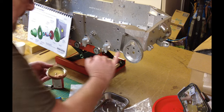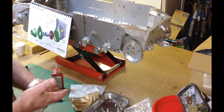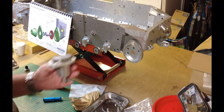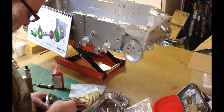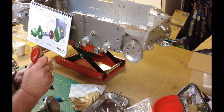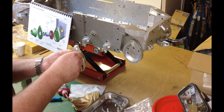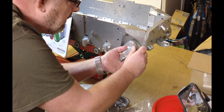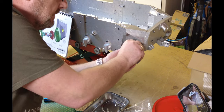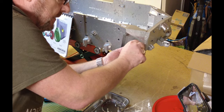Before this tower goes into position, I've got a bit of copper slip here. They do ask you to put something like this onto this brass piece here, just in case the gear binds with it. So I'm going to start putting the cover fixings in and my son will probably speed things up because there are 15 of these to go in. I'm going to pop the first one in, just wind it in with my fingers first, and then do the diagonally opposite one.